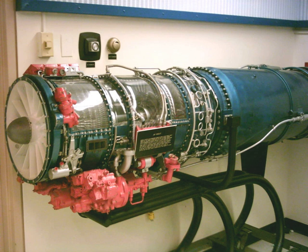Several variants were produced. The J-85-21 variant added a stage ahead of the base eight-stage compressor for a total of nine stages, improving thrust. More than 12,000 J-85 engines had been built by the time production ended in 1988.